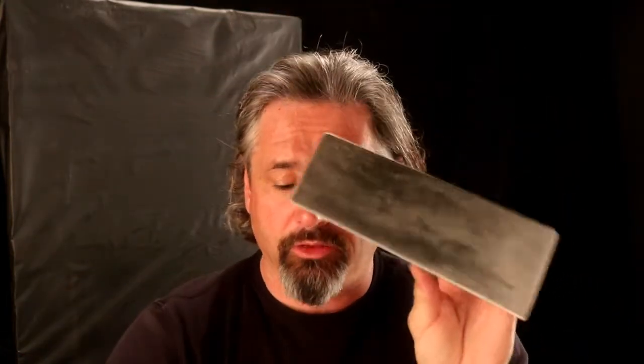There are a lot of different trowels. I mainly work with trowels made by the company called Pavan out of Italy. They are the green-handled trowels. This is the small trowel. They're all stainless steel — very high-quality stainless steel. And they're also trapezoid shaped, so they kind of get into those little corners a little easier, and not just little corners, but some of the bigger corners, some of the real big areas.